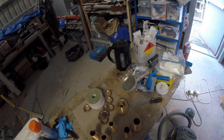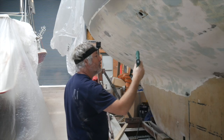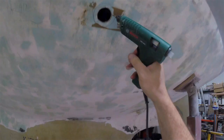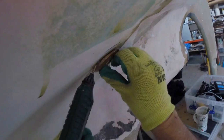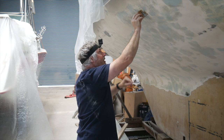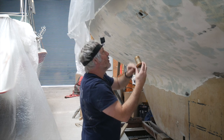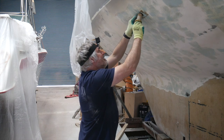Hopefully what I have here is some through-holes that have got a good amount of release wax in them so they won't stick to anything. Step two: get out the hot glue gun, which is fast becoming my best friend. The idea is that I'm going to use the skin fitting to find that perpendicular angle and use this as a guide to bed down the backing plate. The wax works — that's good.